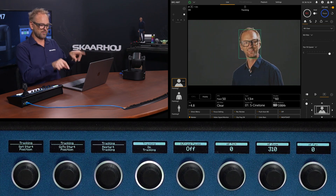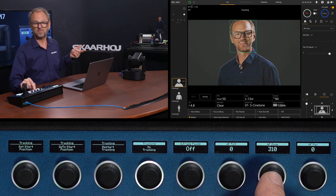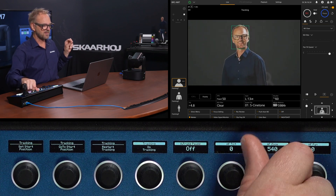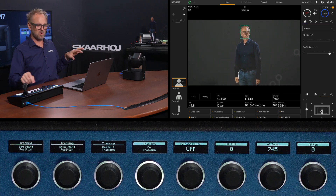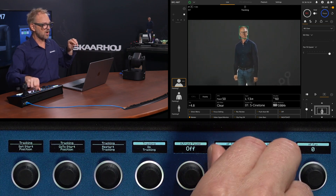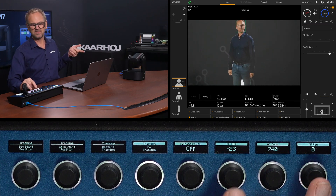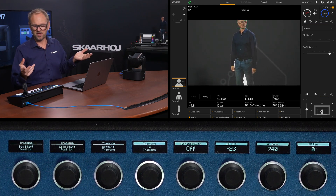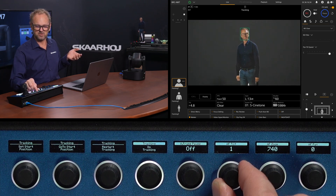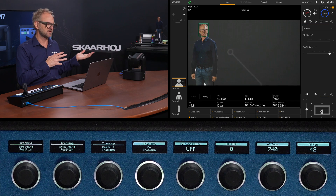The AF zoom — auto framing zoom — can be changed from the UI. If I change this value I can go to a tighter framing, or going the other way gives a full body or half-body shot. There's also a tilt factor, so if I want more air above the person's head I can adjust that. The pan value lets me position the person to the left or right side of frame. The zero values represent a centered framing, which is normally what you want when tracking a person — think of them as offsets from an ideal position.